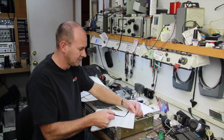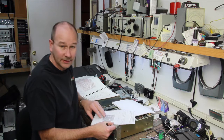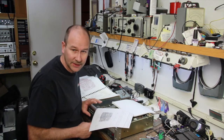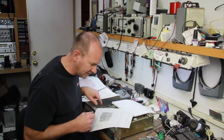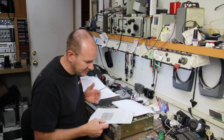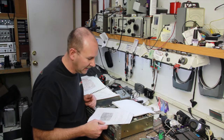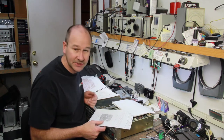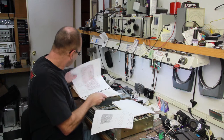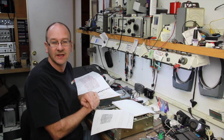This is an old Studer bulletin from back in Nashville — they used to give out these little extra prints that tell you what to change this resistor to. If your lamp is dim after you replace the light and you want it brighter, you might check R52, which is right here. A lot of people changed those out. R52 is supposed to be 4.7 to 5.6K, and a lot of people put in a value of 10K resistor — that would make the lamp dimmer and extend its life. So make sure that stock hadn't been changed out to something that will cause it to be dim.